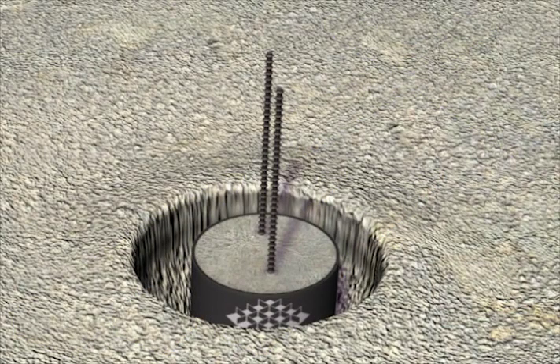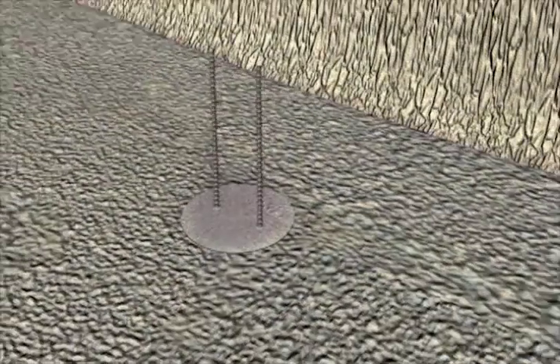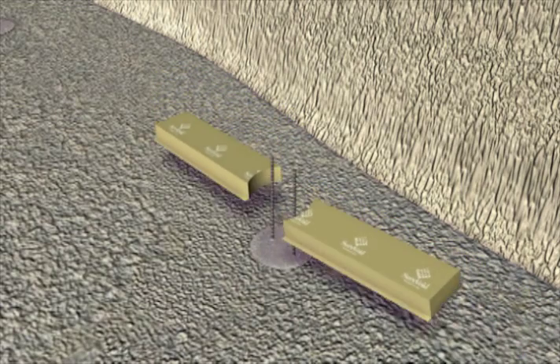The top two feet of the pier is formed by using the Sure Top. The open area around the caisson is backfilled. The arc void pieces are placed at either side of the piers as shown.